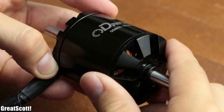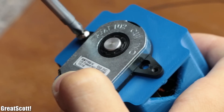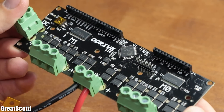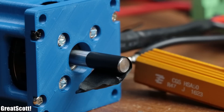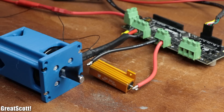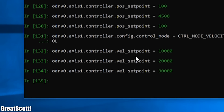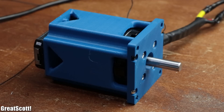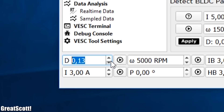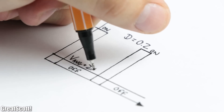To simulate the situation, I will be using an O-Drive BLDC motor with a 3D-printed motor mount and an attached encoder to the motor shaft. In combination with the fitting O-Drive control boards, this motor becomes powerful and quite versatile — it can be rotated very slowly, almost completely silent, and with a holding torque due to the encoder. Since a more appealing graphical interface would be more suitable, I switched to the VESC. After calibrating the O-Drive motor with the VESC tool, I will be using duty cycle control, meaning a set duty cycle and average voltage will be applied to the motor phases.